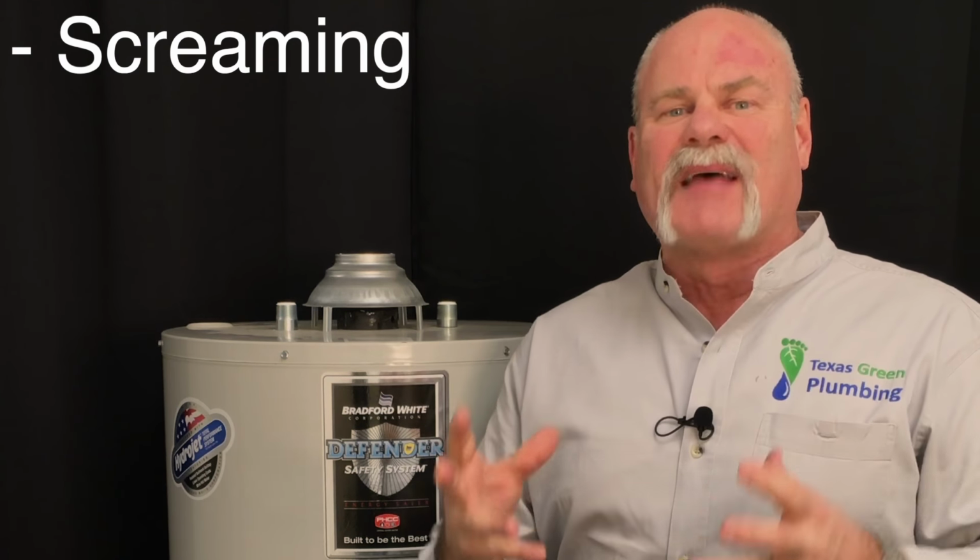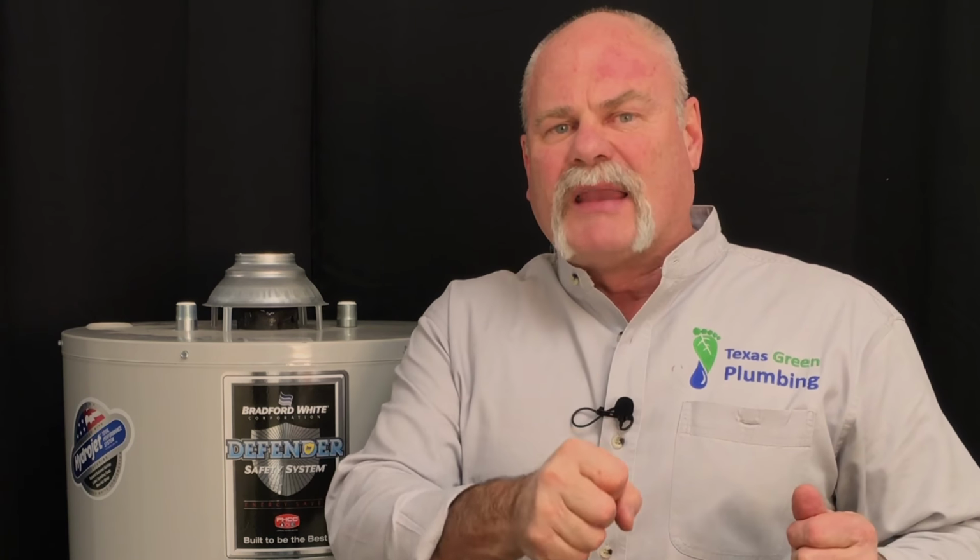Sometimes you hear that noise of water screeching, like a screaming type of a sound. What those noises are, even though we're talking about water heaters, they can happen on a toilet if a valve does not completely close. And your fill valve is a valve, and if it doesn't close all the way, water can screech through it. Hot water, for some reason, tends to make a little bit more noise. So if you've got a valve that didn't get closed all the way, it can make a screaming noise. If somebody has done some work on your water heater and maybe they didn't open your valve all the way, it can make a screaming noise there.